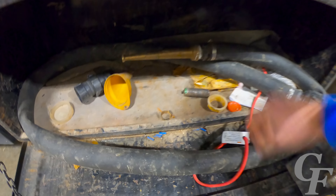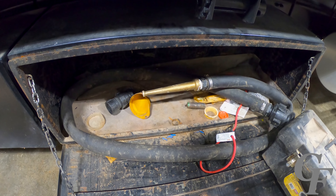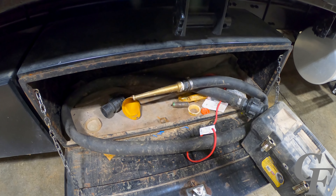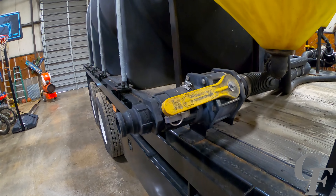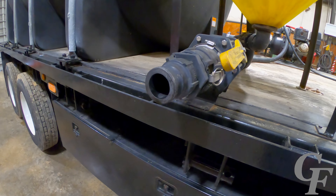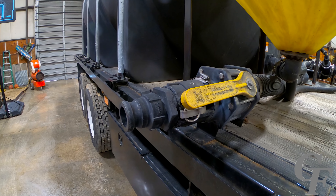We've got a 3-inch hose on it for filling. We can fill our 1,000-gallon sprayer up real quickly. For the motor and the pump, we've got a Honda 390cc motor on it — I think it's probably around a 10-horse motor. It's got an electric start for quick start-ups. Right here in front of the tank is where we've got plenty of room to store our chemicals. We've also got our pump and mix vats.